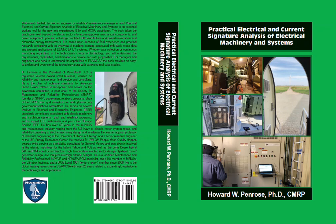ESA provides a non-load-dependent, repeatable method for evaluation from a remote location such as the Motor Control Center. The patent and research included work on pump impellers, belted applications, and more, which have only recently been rediscovered as applications for ESA and MCSA.